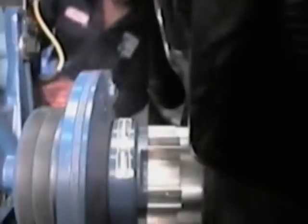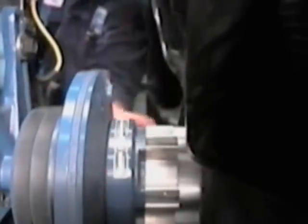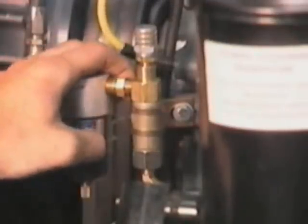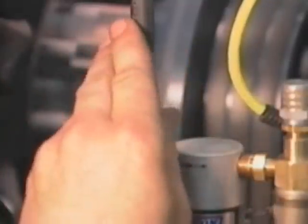Every 10,000 miles, after visually inspecting the fan clutch, check for air leaks around the air chamber and between the PFD and the friction material, the system sentry fuse, and the air inlet port. Also check for leaks at the solenoid valve and filter assembly, as well as in the air hoses and connections.